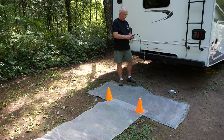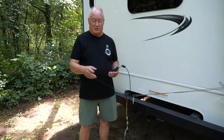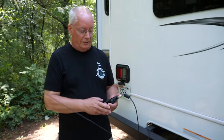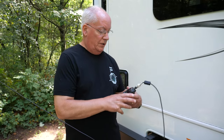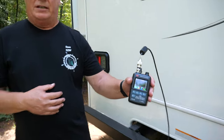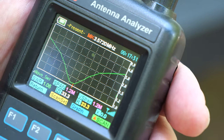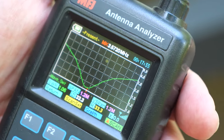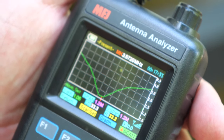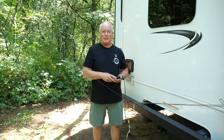So we've got the antenna analyzer here and we're going to do a sweep and see how this thing does. Remember, a 67 foot wire is a quarter wave on 80 meters. So there's the sweep — it looks pretty sweet to me. And instead of being limited to just 70 kilohertz, the 2 to 1 VSWR bandwidth here is actually almost 400 kilohertz. Problem solved. Now we just have to wait for the sun to go down and we'll see how this thing works on 80 meters.